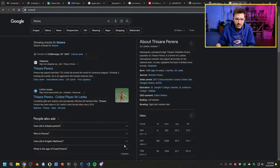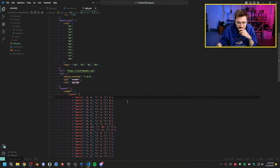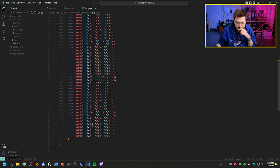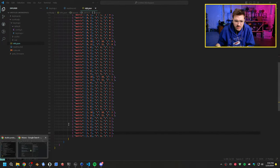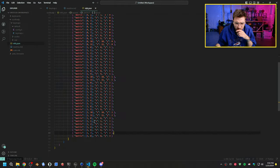So we have the left one. Do I have my matrix reversed, possibly? Here. It was 0001. The 30 should be here. I might have reversed these. Possibly did. Let's see. Yeah, because these are doing things. What is that one doing though? That's escape. Yeah, my bottom matrix is reversed. There's something wrong here.